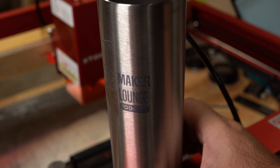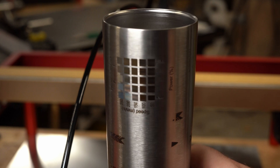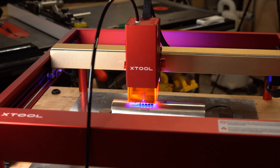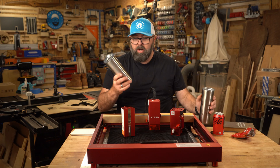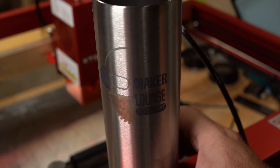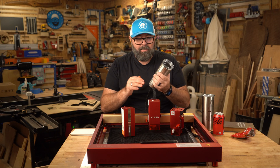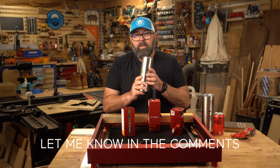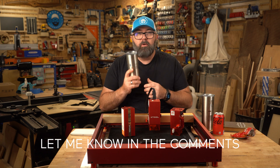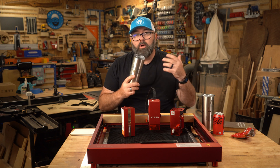I think a lot of this has to do with the space. On the test, the squares are like three or five millimeters, so the laser is passing back and forth really quickly and doesn't have a chance to cool down. But on the larger logo, it's bigger than three or five millimeters, so it has more chance to dissipate that heat as it goes across. I think I really have to play around with those settings a little bit more to get a better orange. If you're familiar with this type of engraving, leave a comment below and let me know if I'm on track.